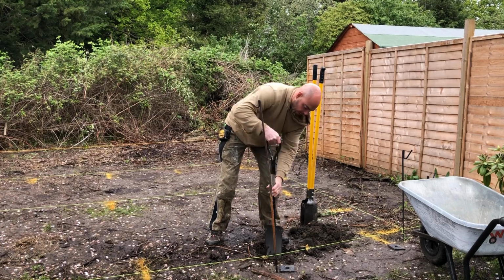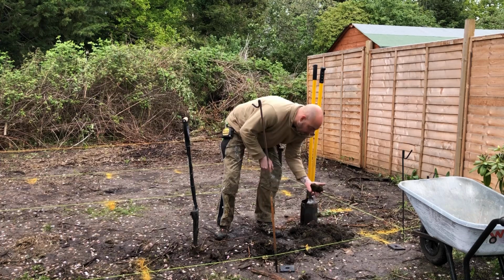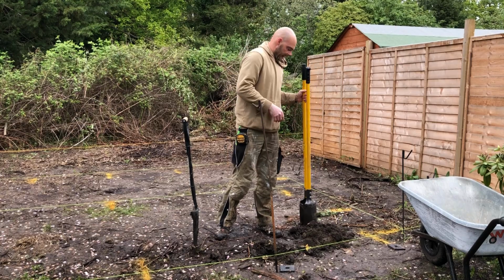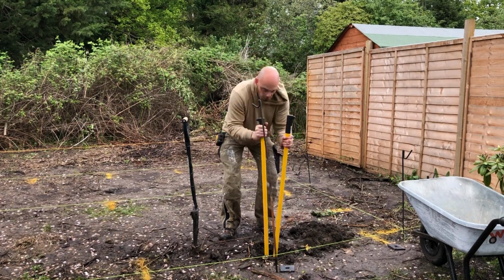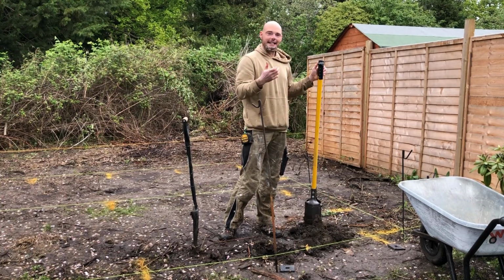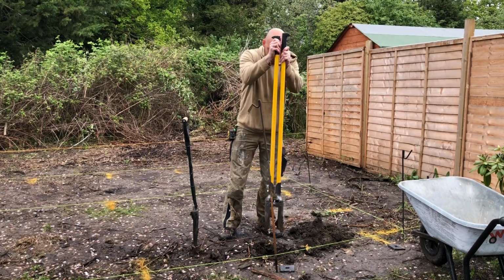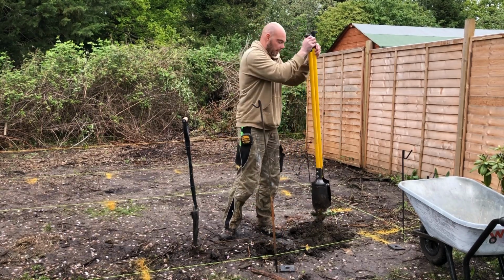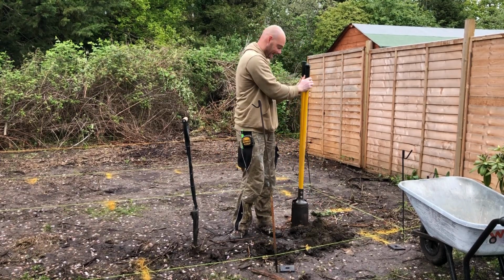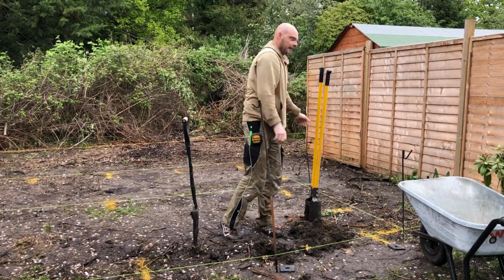This spade is lovely for digging. And you can see there, I don't know if you can see on the camera, but it's becoming a bit yellow. So basically we're hitting clay and a bit of sand, and that's perfect. Once you get down to that level, clay is brilliant because clay is dense, it's thick, and it supports weight perfectly. So once you get to that point, you know you're on great footing for your post to go in. Yeah, that's beautiful. That is really nice actually. Right. Excited about clay. Living the dream.